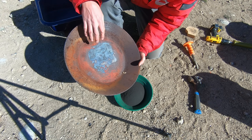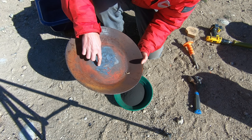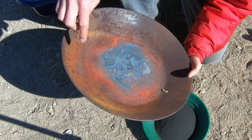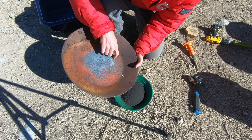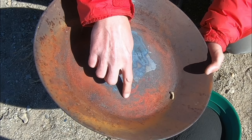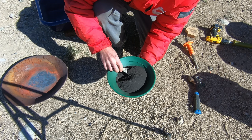The roasting pan I used started burning and we got a thin layer of steel that came off, so I removed those little flakes from the concentrates. We still have a little bit baked onto the steel that I can't get off without taking the metal with it, so we'll leave that there and mix up the cons with the flux.